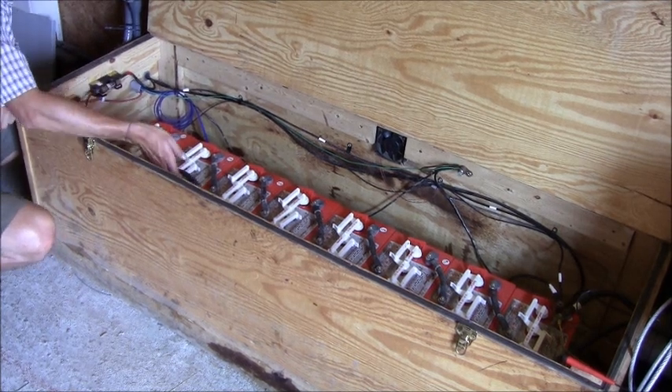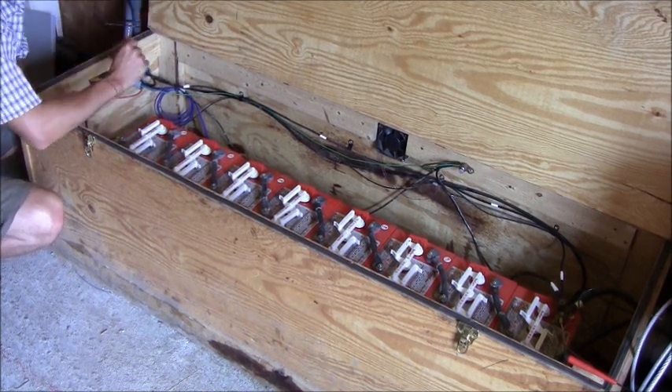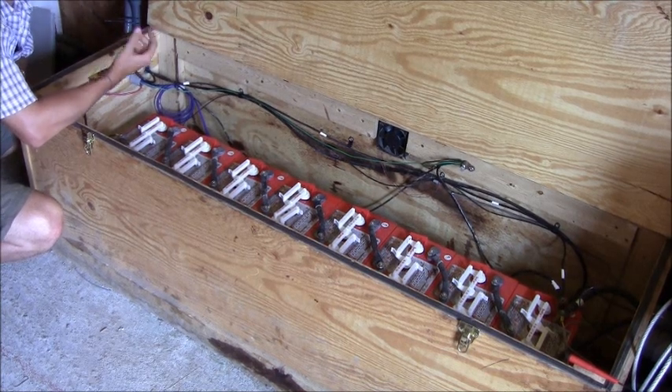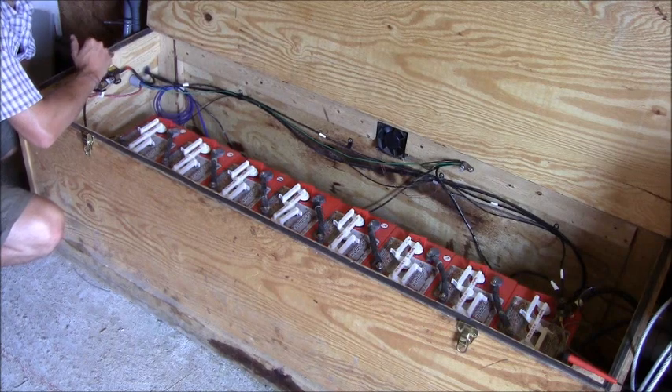From the positive side here, we have our inverter cable as well as the negative, which connects to our inverter, where the DC current is either inverted back to AC to supply power to your loads, or sold right back to the grid for excess electricity.